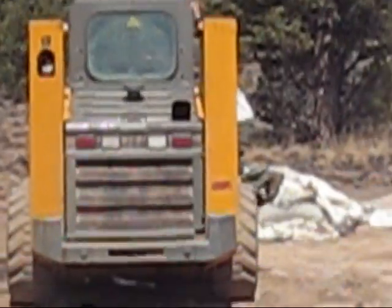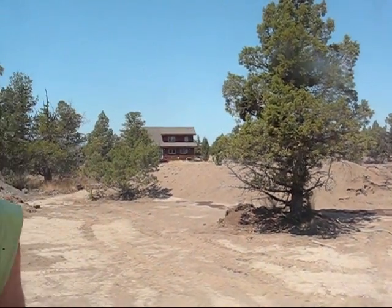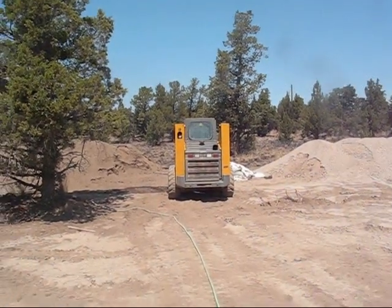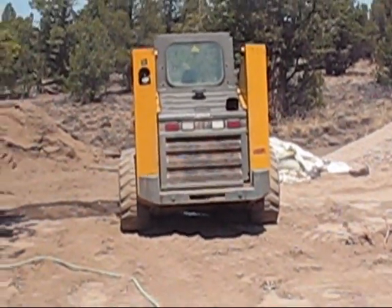But in any case, what we do is about a half barrel of water, and the Portland cement goes into the water so that it mixes up very well. The clays go in, and that's what Vincent is mixing up right now, because it takes a little more time to dissolve them and make them available. So what we have now in the mix is clay, water, and Portland cement.